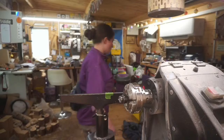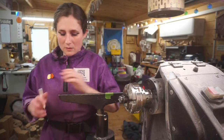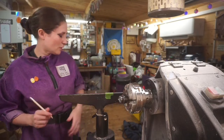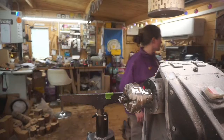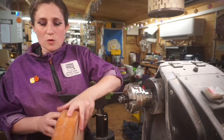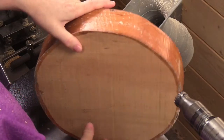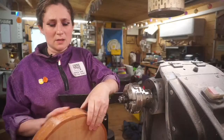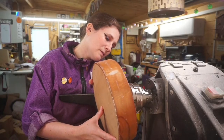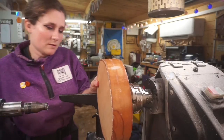It's really, really simple to do, and it's much more accurate and far less confusing than using those horrible centre finders. That's my centre point there. So I've got it on one side. This has been rounded off on a bandsaw, so it will be more or less 90 degrees. Your blades do wander, but we'll bring that up.